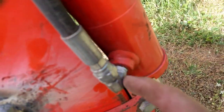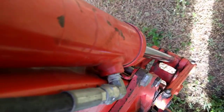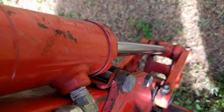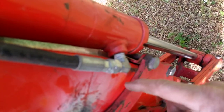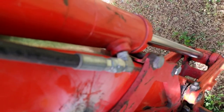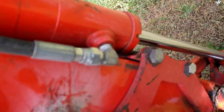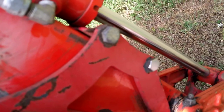I'm not touching it here, but look where Kubota put their fitting — right in the way, so there's no clearance. That thing bends a little bit because this fitting interferes, and I'm not about to notch out the arm just to fit the fitting. For now, at least, I've reduced the flex a lot — as you can tell, it's not touching the thumb anymore, because it was hitting on this bolt. So that's my fix for that.